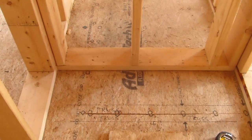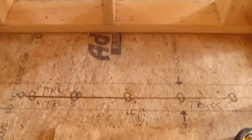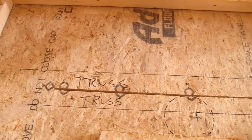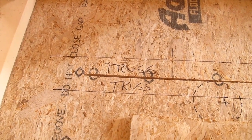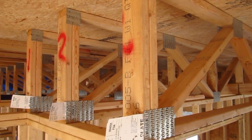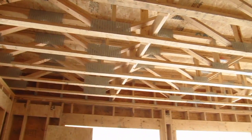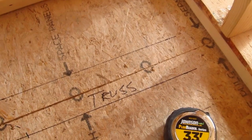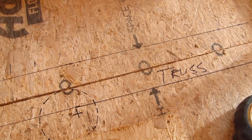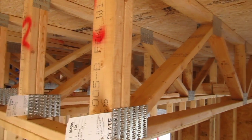That is perfect — that's really what you want to have behind a toilet if you can make it work out. But let me show you what's going on down here. This house was framed with really ingenious floor trusses. It allows you to span great distances — in this case 28 feet — with no bearing walls. Isn't that cool? So these two black lines in between the arrows, that is the width of the floor truss. It's three and a half inches wide.